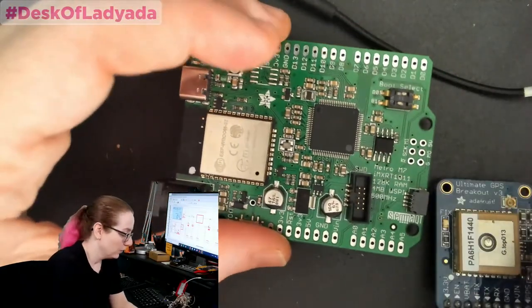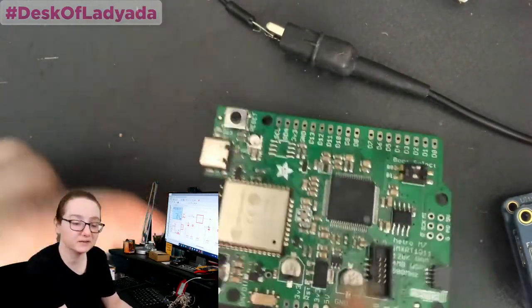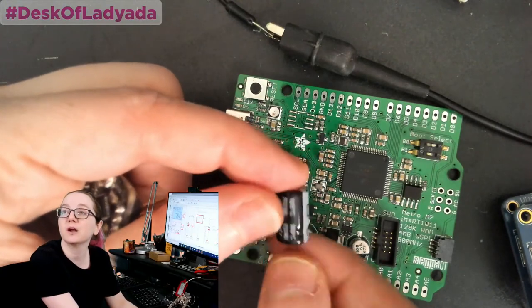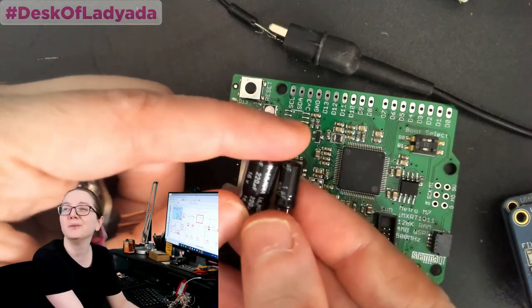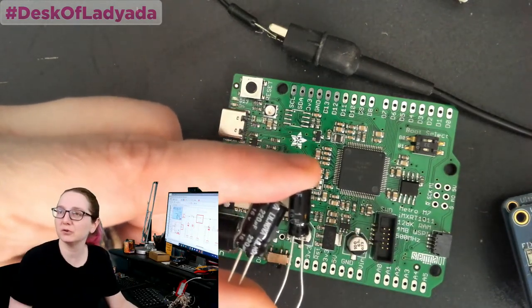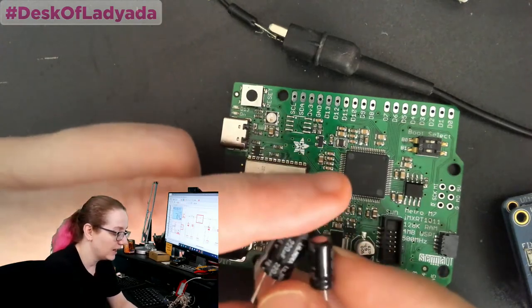What is an electrolytic capacitor compared to your standard ceramic capacitor? This is an electrolytic capacitor — it's metallic, it has a marking showing which side is negative. If you're using through-hole electronics they look like this, they come in various sizes. This one is 220 microfarad and this one is 1 microfarad. You'll find them ranging from about 0.22 or 0.47 microfarad all the way up to farads — you can get supercapacitors at thousands of microfarads, up to 1 farad.